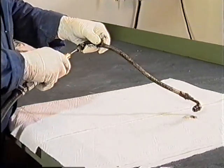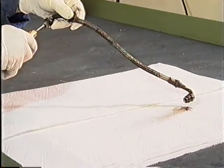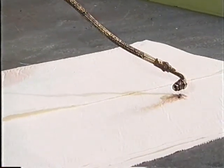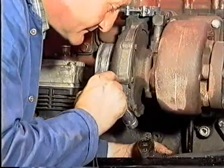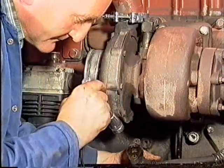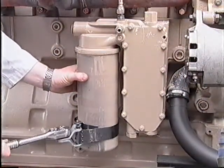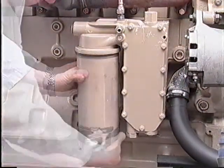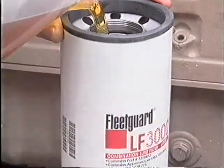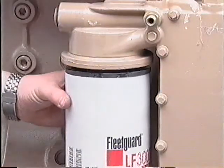With flexible pipes, it is always good practice to flush out before fitting, as loose particles of carbon may be forced into the bearing housing with the new oil. Inspect the oil drain tube for any blockages, restrictions or cracks. Replace the engine oil filter using the manufacturer's recommended specification. Be aware of low-quality replacements, and remember to fill the oil filter canister with oil before fitting.